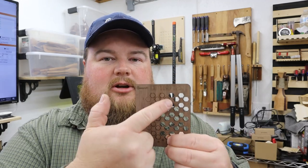The profile for this cut job is too slow and too powerful for just 3 mm plywood, but I wanted to make sure it cut out completely. Looking at this, I can say with this particular material I can run as fast as 7 mm per second and as low as 60% power. I'll probably choose 7 mm per second at 80% power. I don't like to run my laser at full bore, and I don't always choose the lowest setting — you're going to run into hidden variations, glue lines, filler knots, or other things in your material, so choosing the lowest power setting is usually not a good idea.